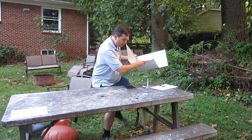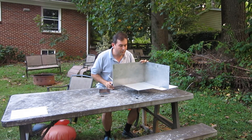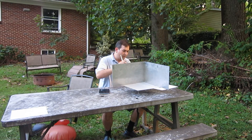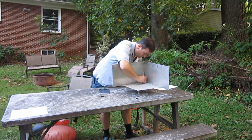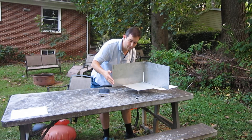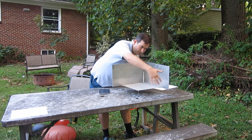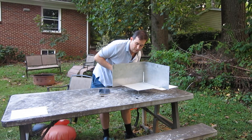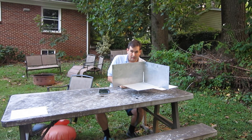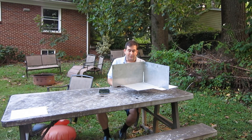The next thing we're going to do is try the big antenna. We'll take the big antenna and line it up along with the marks on the table, and hook up with our same antenna inside of the reflector. What the reflector's going to do is take this whole big area — instead of just a tiny area where the RF will be received — and reflect it all down to our antenna so we can improve our directionality. It'll also improve the amount of signal you get, the gain. Let's take some measurements with this and see how it behaves.